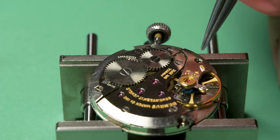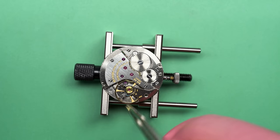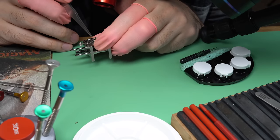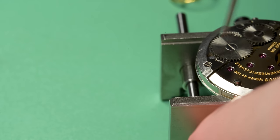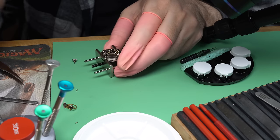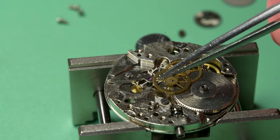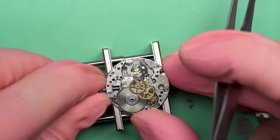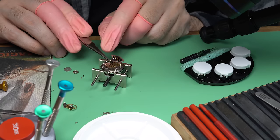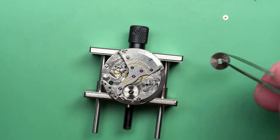A little bit of something there — it's weird. It doesn't feel like it's seating correctly. I think I know what's going on. This stinks — I actually have to take apart a bunch of what we've already done because I think the hack is out of alignment. So I had to push it over so that it would engage when I pull out and push in the crown and stem. It looks like it was on the other side and it was just stuck — stuck in the off position, basically. So let's reinstall everything again.